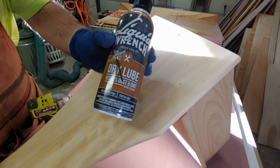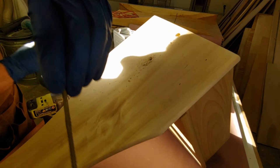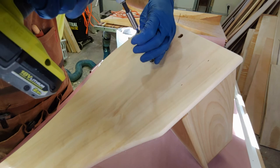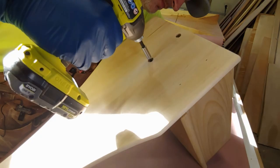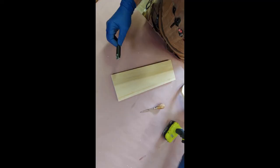Here's a little trick: a little dry lube. When you have a really long screw to put in, put a little dry lube on it. These are four-inch screws — it will help them glide so much easier into the wood. Watch, it just goes right through — not a problem at all. Do the second one the same way. After this we're gonna cut some plugs to put in there. I'll show you the plug cutter I use — it's a Montana half-inch plug cutter, pretty beefy. You've got to be careful drilling with it so it doesn't catch and spin the wood.